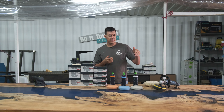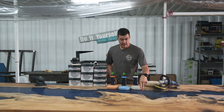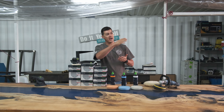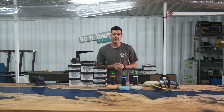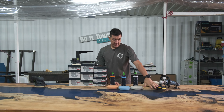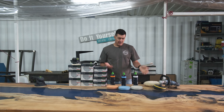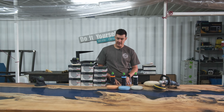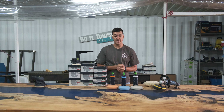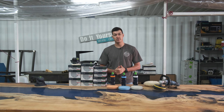A question I get a lot is: why don't we apply oil to the epoxy section of our table? Go take cooking oil on a sponge and add it to a glass window — it's not going to look better. That's the answer. We only apply oil to the wood section; on the epoxy part you just wipe it off. If you're using Rubio Monocoat, you can sand to about 180 grit. If you're using Osmo oil, we typically sand between 400 to 800 grit, giving you a much smoother surface.